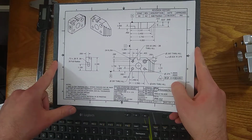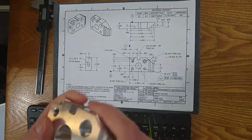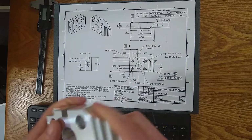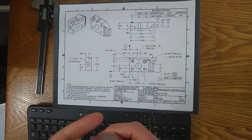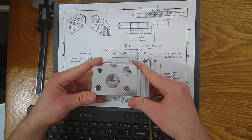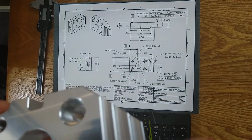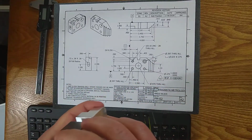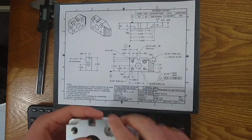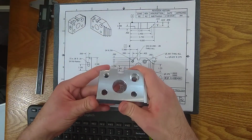I want you to remember that the standard for the industry is if there is a coating, say it's an aluminum oxide coating, hard anodized, that's what I was trying to think of, soft anodized or hard anodized. Well, that adds thickness. These coatings add some thickness to the part, and in the manufacturing world, those thicknesses matter. It's not just, oh, forget about it. It won't affect the function of the part. It actually will, with how tight tolerances are.